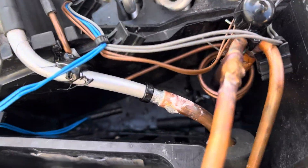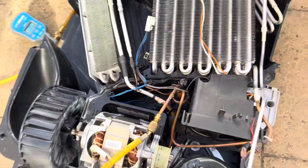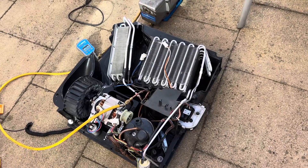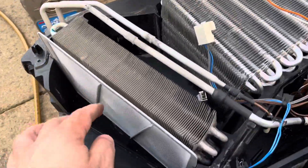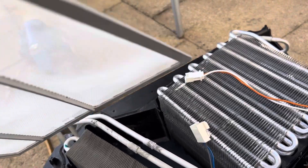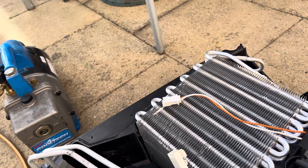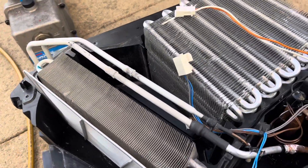I had to braze this pipe because I had a refrigerant leak and the dryer lost its properties. That was my mistake because first I opened this dryer and I cleaned these filters. Many people chuck them in a bin, but you don't have access to this filter because whoever designed this made it very awkward.